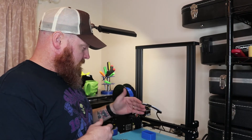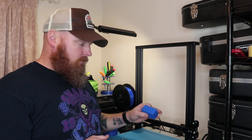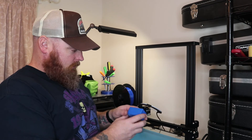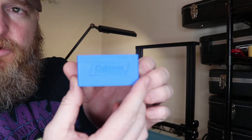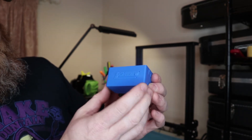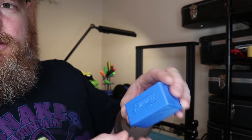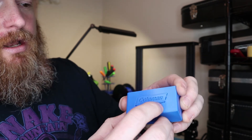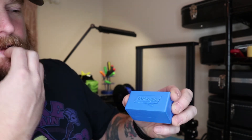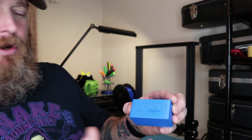It's the next day. I let this thing print and realized that I had a 32 gig memory card in and it wasn't enough, so it ran out of SD card space. That's why you didn't see the full time-lapse. Let's take a look — Coleman here looks a bit rough. The edges came up a little bit; I thought I had the bed hot enough but possibly not. There was some stringing here, and if I had put supports under it it probably would have been all right, but I didn't need supports on the other side, so I'm not sure if it's a model problem or my settings.